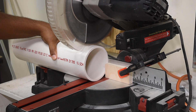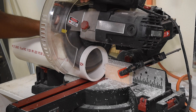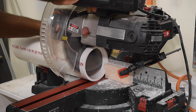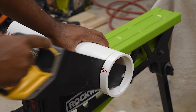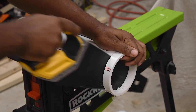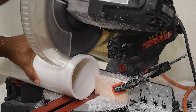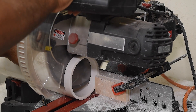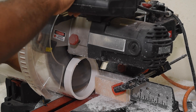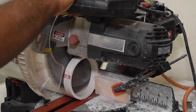I'm going to use a 5-inch PVC for the mold, and one of the challenges here was I'm using a 10-inch blade on my saw so I cannot go all the way through. I'd have to cut what I can and then take a handsaw to make the rest of the cut. You can do this from start to finish with a handsaw, but the best thing to do is mark a line so you know where you're cutting. I made the rest of the cuts on the miter saw and just turned the PVC pipe until I was able to cut through.